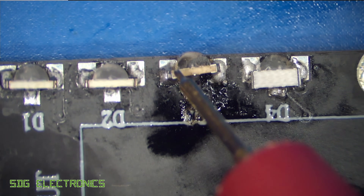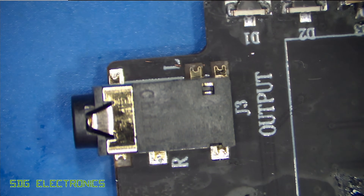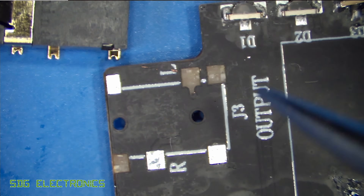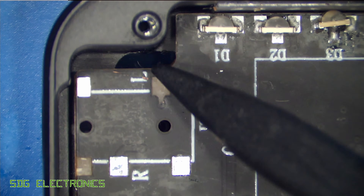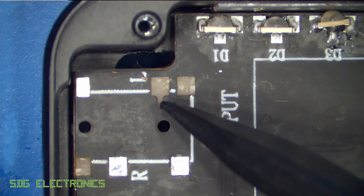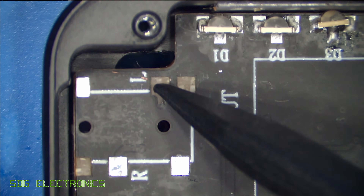We could stick a 1210 LED on its side if I haven't got these in the same package. We've got a replacement jack here — double-checking it actually fits. Yes, that's definitely the right part. Now we need to work out how to get the signal back to the left channel connection. We could drill through the PCB, or run a wire around onto the other side of the board. There's actually lots of room to run a wire from this pad around the other side onto that resistor. The difficulty with scraping solder mask off the trace and soldering directly is that heat flowing down the wire could desolder the joint underneath the jack where we can't verify it. So I'm going to have to run a wire around the outside.